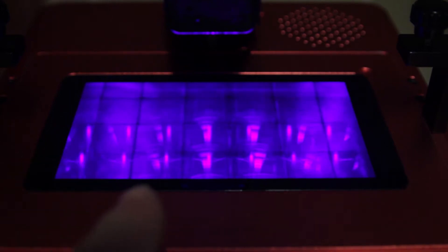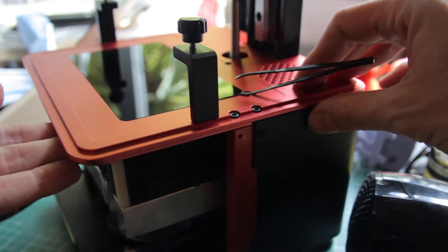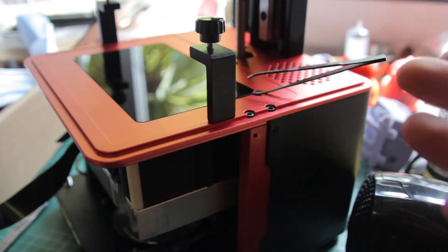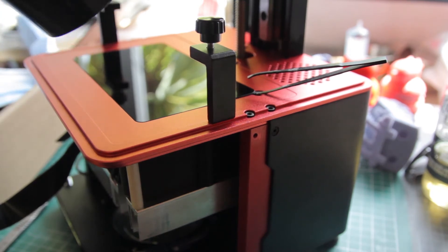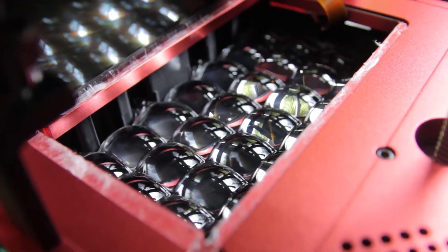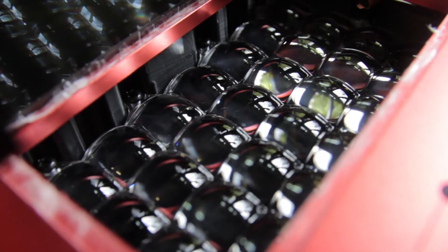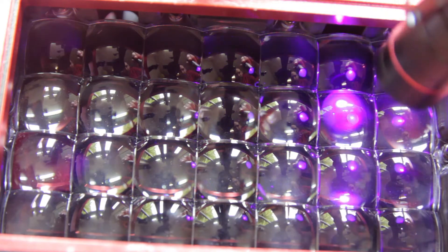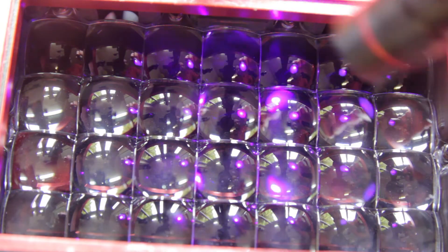I can see the grid right there — that's what I'm getting on my resin. Now, this screen is not coming out easily and I think it's going to crack as soon as I try to pull it out, so it's not as simple as a five-minute job. I'm going to sit for another 20 minutes and try to heat up the glue. After lots of heating I finally prized it up and I can see the grid pattern inside. I'm checking with a UV light to see if any resin leaked in — I don't see any traces at all. Nothing has touched that matrix, so the printer itself is in perfect condition.